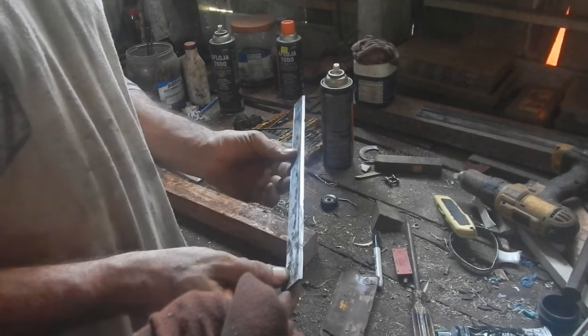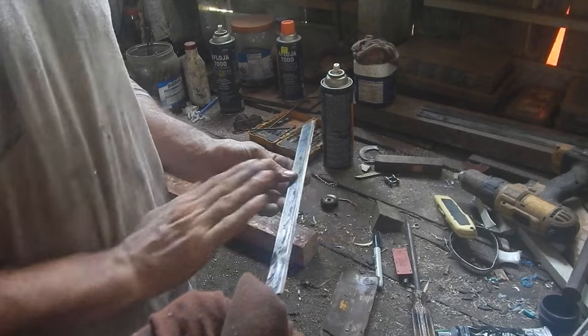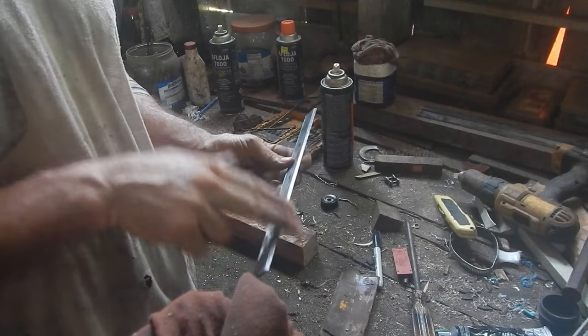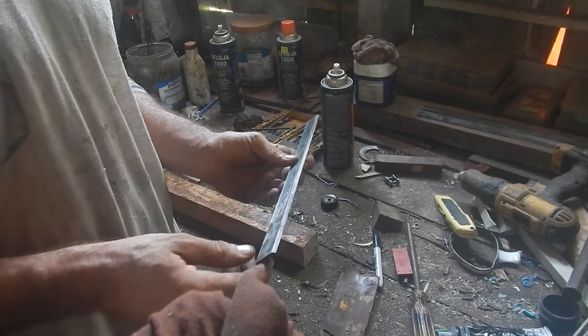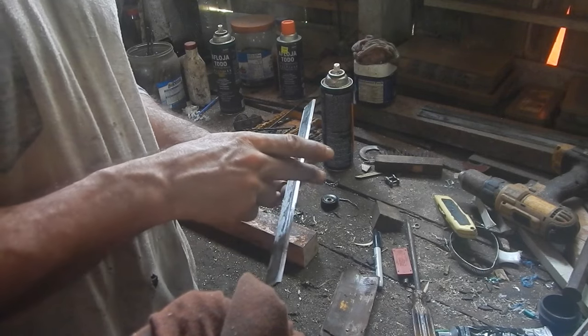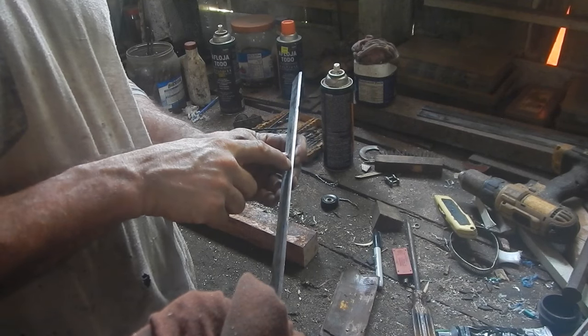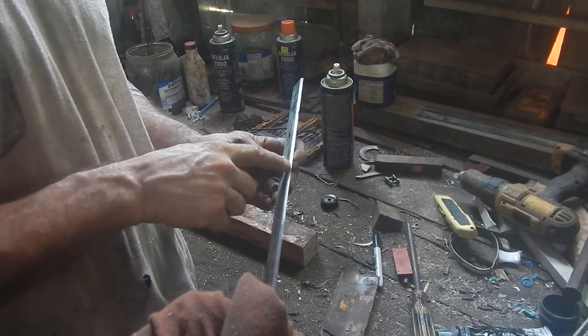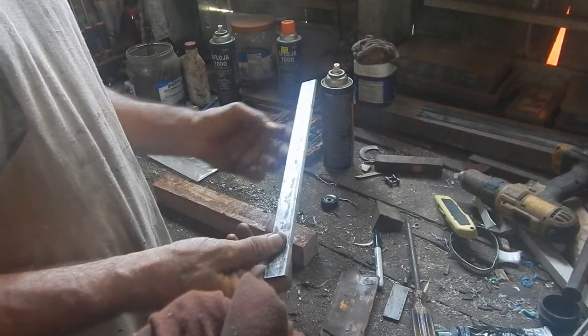How is the edge really messed up? Well, it's curved like that, for one. Probably because it's been sharpened a bunch of times that way. And it doesn't work right, because then the sharp edge isn't hitting the wood first. It's like this edge here is hitting. That's why I'm getting some not stellar results.